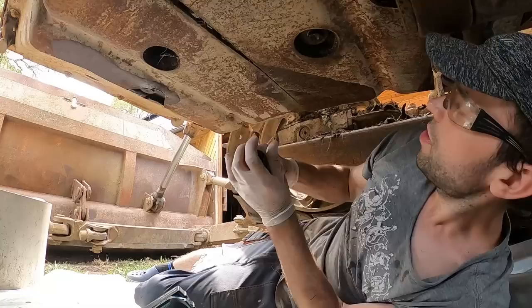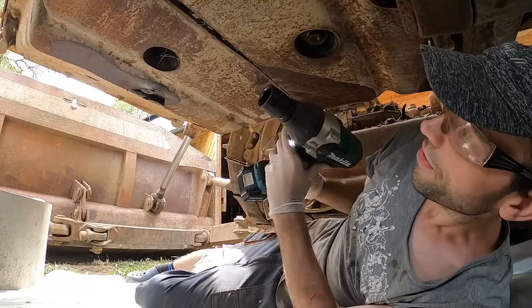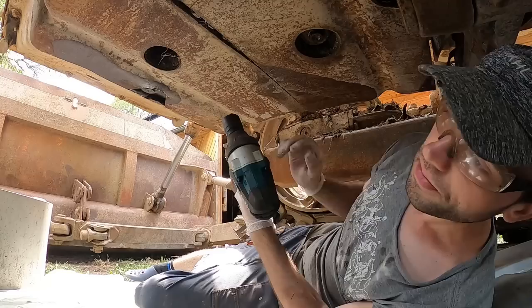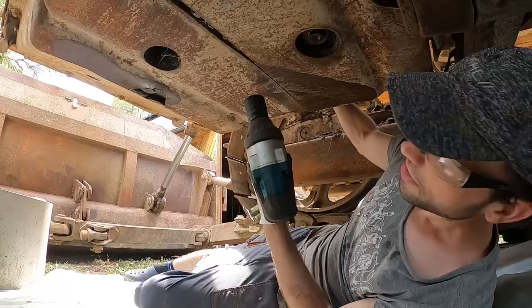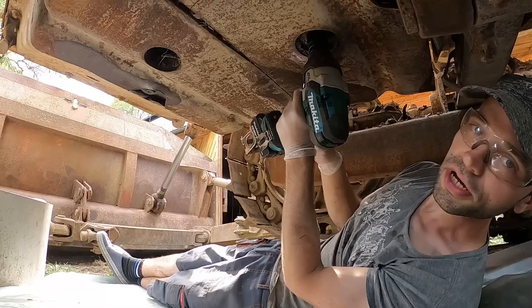Now, while I was doing the troubleshooting, I did pull about 20 liters of that watery, very low viscosity liquid from the sump. I mean, that thing was like water, let's be honest. Not gonna sugarcoat it. And I added about 10 liters of engine oil back to the sump. My only goal with that was to see if I can get the pressure up. And I did. The pressure went from 1 to 1.5. Nicely stayed there. So I'm hoping with the full oil change, I can get the pressure above 2, which would be perfect.